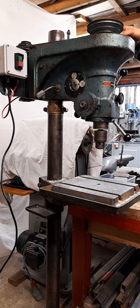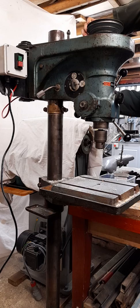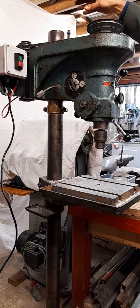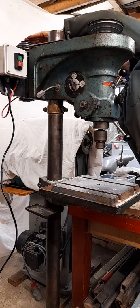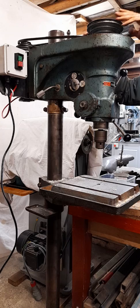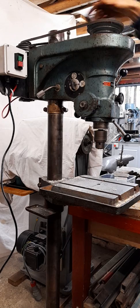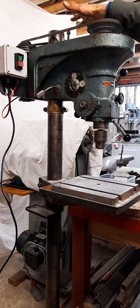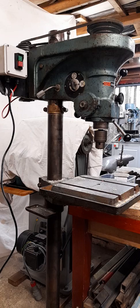At the moment we're in a faster speed. I've got the belt tension set so it's reasonably easy to change. The belt is a bit slack, so there's a chance of belt slip, but then again if things jam it's much nicer to just let the belt slip a bit rather than have something more catastrophic happening.